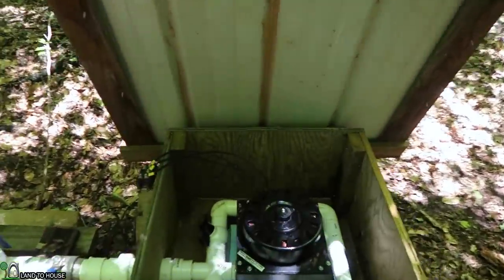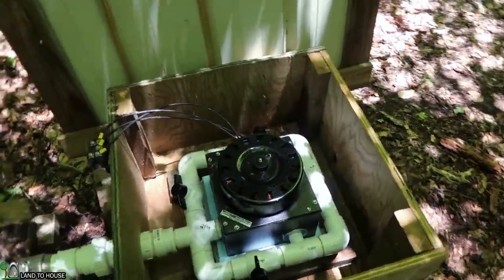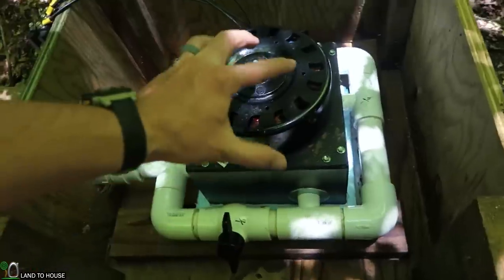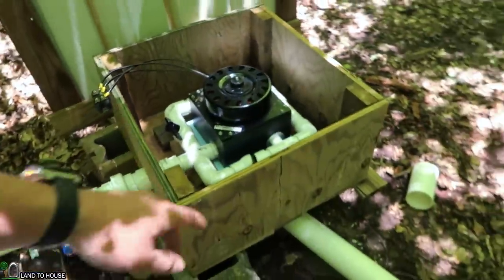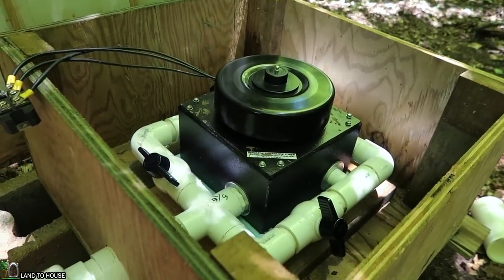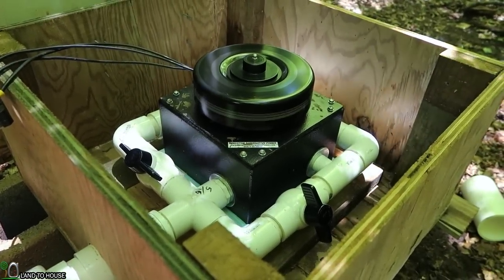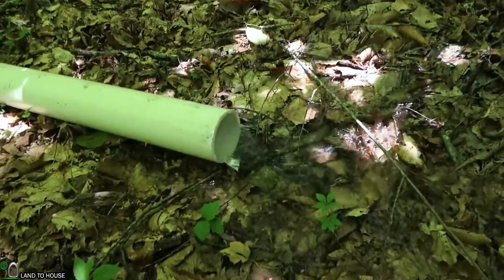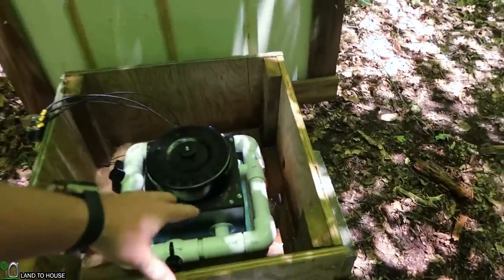Whenever I put the turbine in, there was water escaping around the edges. I tried putting the blue foam under there and that worked, but the problem is it's now creating a vacuum and slowing the turbine down. Let me show you what I mean — the turbine reaches its full speed and water starts coming out, but a short time after it's been going it will pull that suction and get stuck. The motor actually goes faster when there's less water backed up in there.